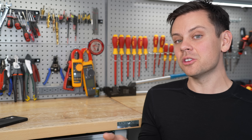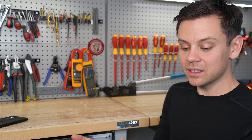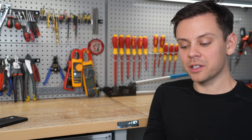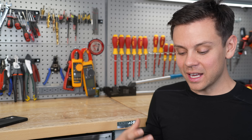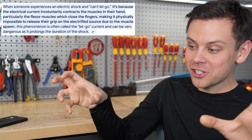In some instances you can even have a dislocation of a joint if the attached muscle puts it into an unstable position and it pops out of place, causing joint capsule and ligament damage. Also if your breathing muscles are being electrocuted you cannot breathe because they're convulsing. The scariest muscle convulsion is in your hands — if you're getting shocked by something you're grabbing, the convulsion will cause you to grip it harder, and the longer you're shocked the more damage occurs.